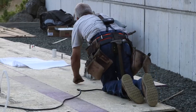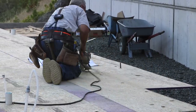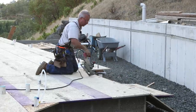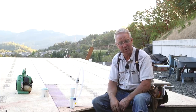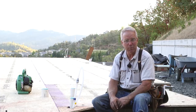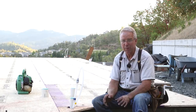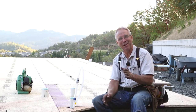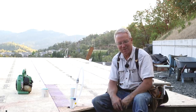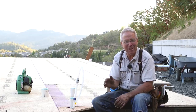This is not a time to speed through a 40-foot straight shot or a 32-foot straight shot. This is a very deliberate, very accurate skill saw cut. And that's accurate enough. If you don't have all the confidence in the world in your skill saw cutting, err to the inside. I mean, if you're going to run off this line, and everybody's at that point at some point in their career, cross it to the inside.